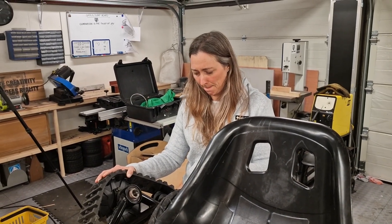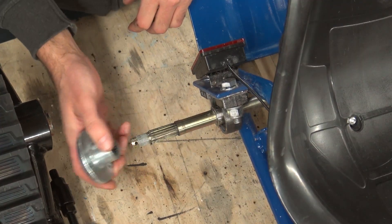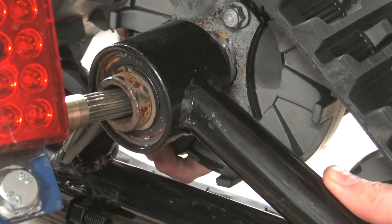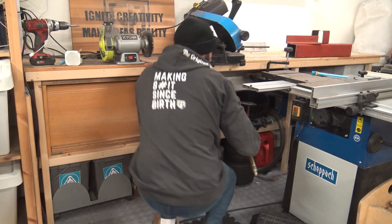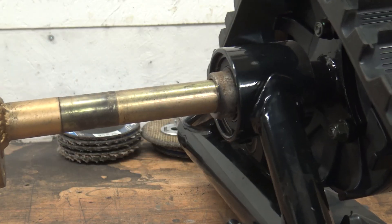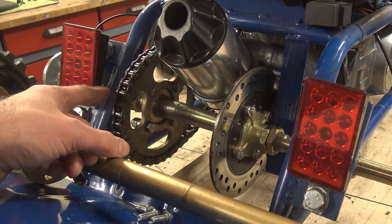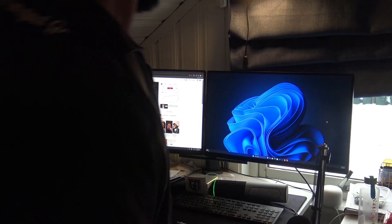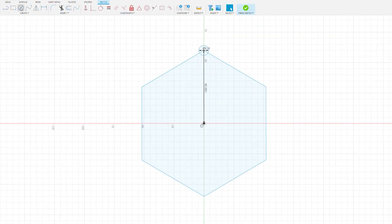So now I have to find a solution on how to fix that. The snow tracks ran a T23 spline and my rear axle was only a T17. But lucky for me, I had a T23 splined rear axle from my pallet go-kart — which was probably the silliest thing I've ever built — but the rear axle happened to be a perfect fit. I could have just changed the rear axle, but then I'd have to change the brake position, drive gear position, and this one was way too long.